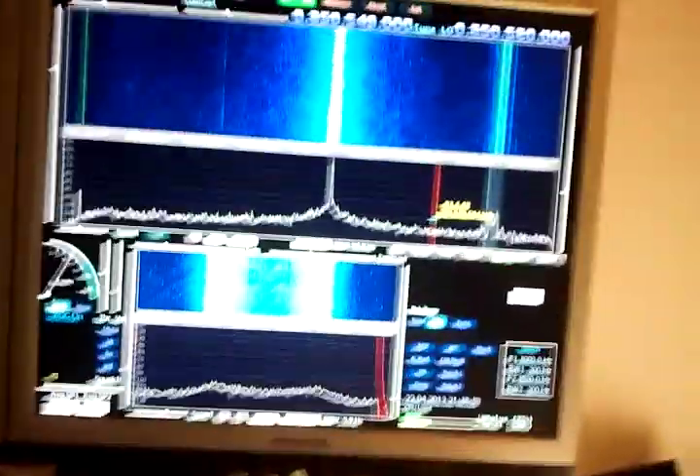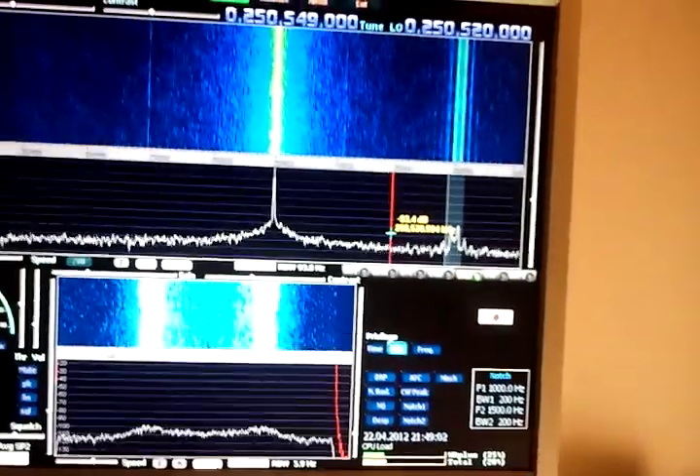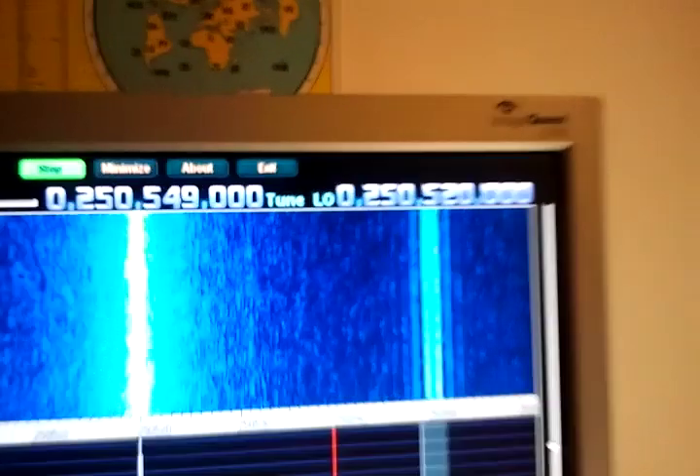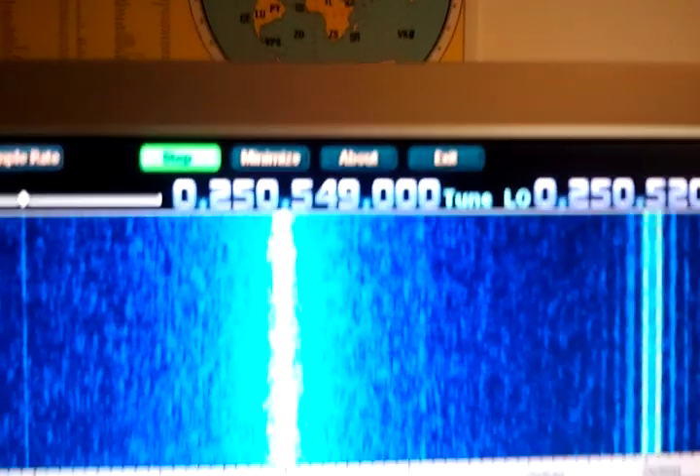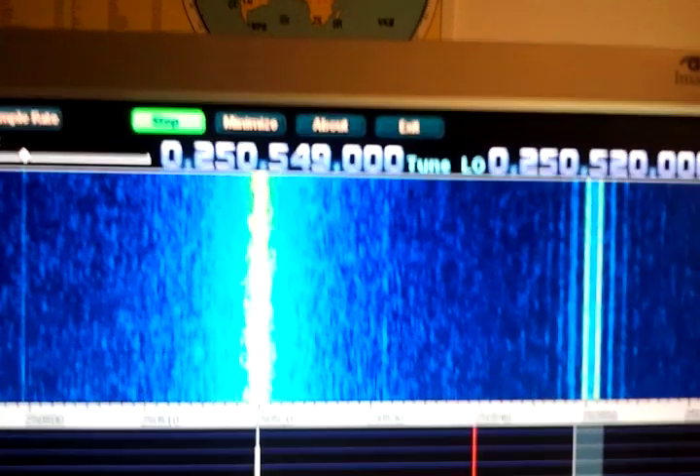And I'm going to compare that with a DVB-T stick. What we get here is a so-called FleetSatcom satellite on UHF frequencies. You can see here I'm currently receiving a beacon signal. It's a 1200 baud BPSK signal.